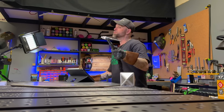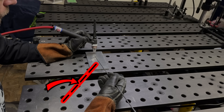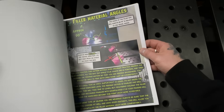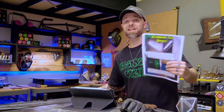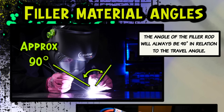There are angles you need to pay attention to. You never want to feed your filler material from the side of the welding pass — you always want to be feeding in line with the direction of the pass. Download the free workbook in the description below; it goes over all this stuff. You can see here you want to feed in line with the pass direction, and a couple of other angles are clearly laid out for you in those pages. We always want to be feeding with the filler material roughly 90 degrees in relation to the torch angle you're using. If you feed outside of these angles, your filler material is going to break off and go into the puddle much more messily, and it's going to be harder to get smooth deposits of filler.